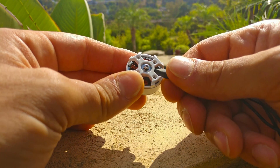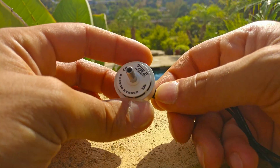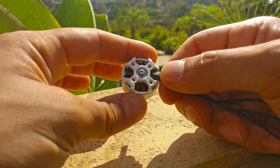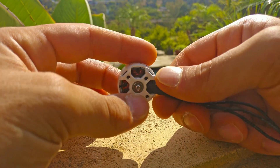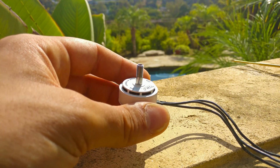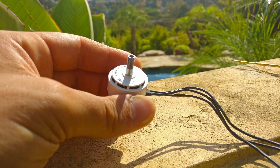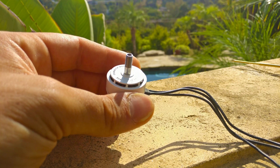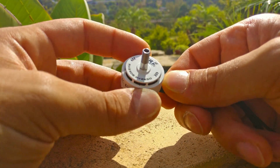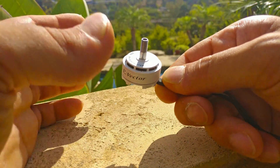I don't know if the quality control is going to hold up, but I'm sure it's going to become a very popular motor. The eight that I have all have excellent quality control — they're all very even, very good. I couldn't find any discrepancies between any of them. The magnets do not scrape the stator at all, even with such an incredibly tight air gap. It's an overall good product. It's from Banggood and comes with free shipping, hopefully shipped worldwide. If you're going to ask me what's a good value motor, this is my selection by a far, far shot. This is the best cheap motor I have found, and I will personally be using it on my own acro quads as one of my main motors for builds.